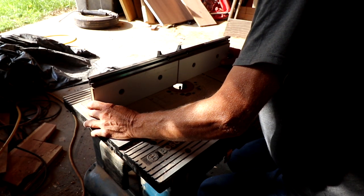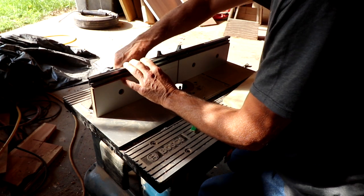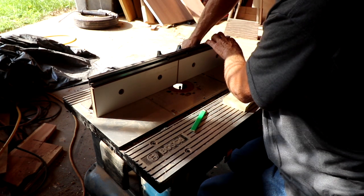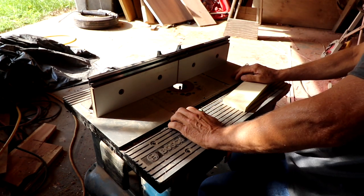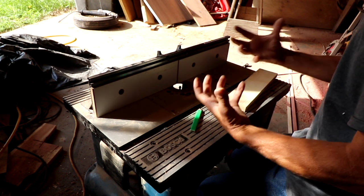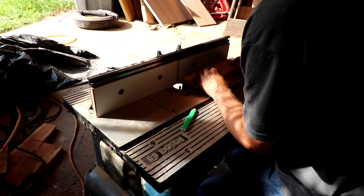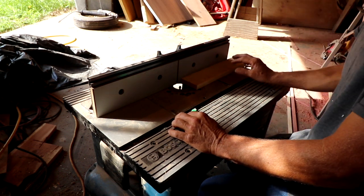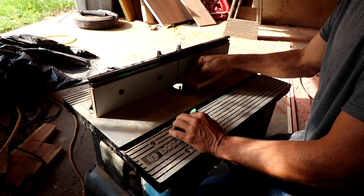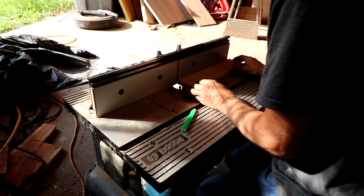Well, what I'm doing right now is those two uprights on the crib that we've been working on, that front part. The other one that I did, I routered them, just kind of three lines going down them, and I don't really know that it's necessary with the red cedar because it's got so much character in it versus the black cherry, but I am going to do a test board here just to see what it would look like. I hated doing it the last time because you go through all that work, and then if your router is off just a little bit, you'll have a crooked line or something won't look right. So I definitely want to have a test piece here first.